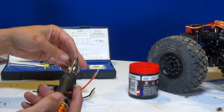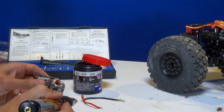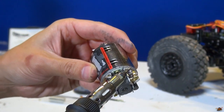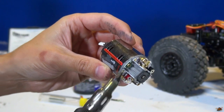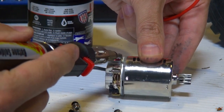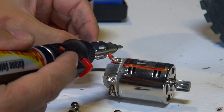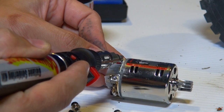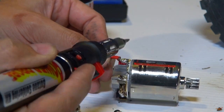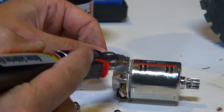I always find a little bit of solder on the tip of your soldering iron helps you melt the other solder a little quicker — for those folks just learning how to solder. That flux cleans and helps it stick. So now I have two motor tabs — black and red. I'm just going to attach the red side, heating up that tab, heating up the wire, letting the solder melt together. It looks nice. I always like to have a nice smooth solder point — nothing like clumpy sharp solder to help rip up your wires if you're not careful. Maybe just a tad more — it was a bit of a cold solder, but perfect.